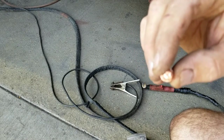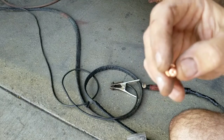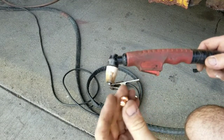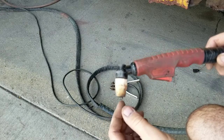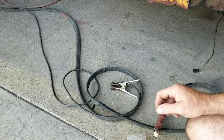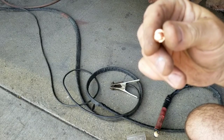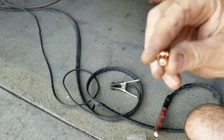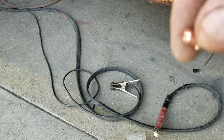Sometimes people say get a really good plasma cutter, but that's up to you. I would buy the cheap one, get the consumables that are cheap, and plan on going through them. To get the cleanest cut, you need a nice fresh tip. I run the air pressure up to the maximum allowed for your machine — that will blow the slag away cleanly and you'll get a nice clean cut. The higher the amperage you're using, the more consumables you're going to go through.